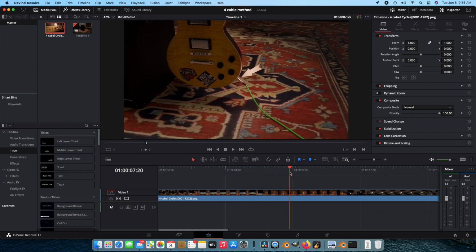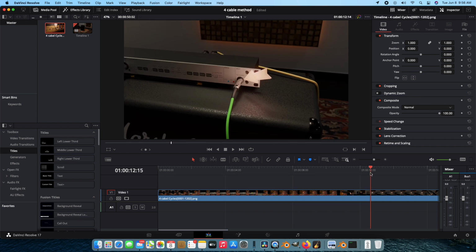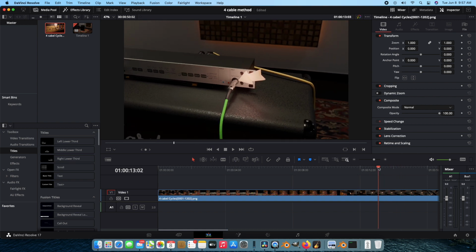But those clever guys at TC Electronics thought, hey, let's separate these two parts, make this rack mountable, get a long Ethernet cable with these connectors that resemble XLR cables. Typical Cat5 connections are not durable. They're not meant to be unplugged and plugged day in and day out for gigging and to withstand being tripped and ganked on. So these connections are really nice. Unfortunately, that cable is extra. It doesn't come with it, so you have to order that separately. But it's worth it because it's very high quality and it's lasted me 8 years so far.